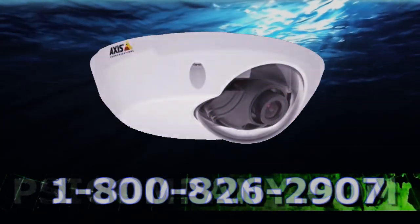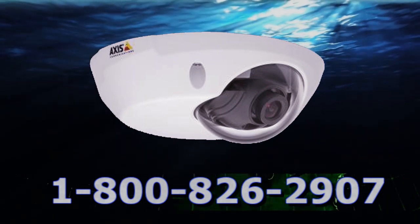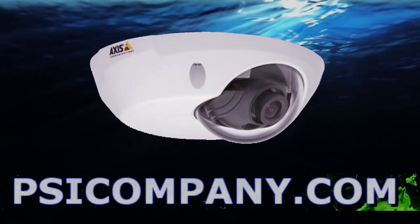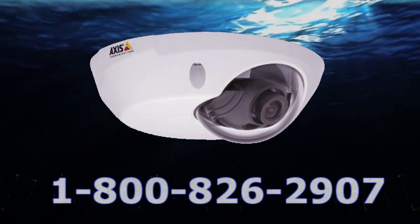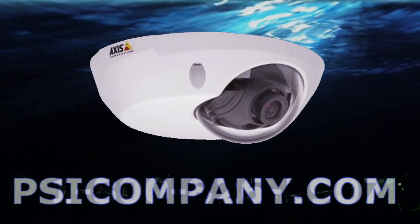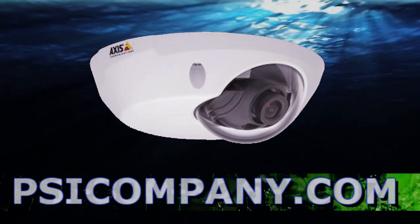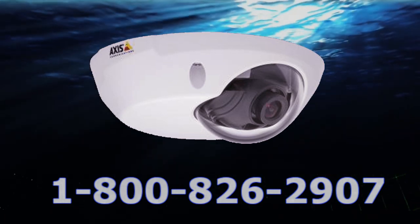You can also employ IP camera video information. The NavNet 3D configuration requires the output of the IP camera to be MPEG-4. We distribute the Axis IP cameras which do feature the MPEG-4 configuration. If you're trying to configure an IP camera to your NavNet 3D network and need help, give us a call. Of course, the display capabilities of the MFD also include various instrumental inputs from engine sensors, gauges, and alarms around the ship, with certain configurations that can speak directly to the MFD12.